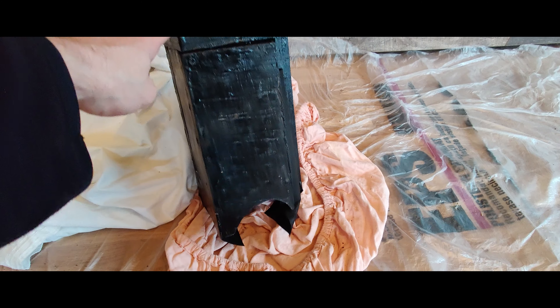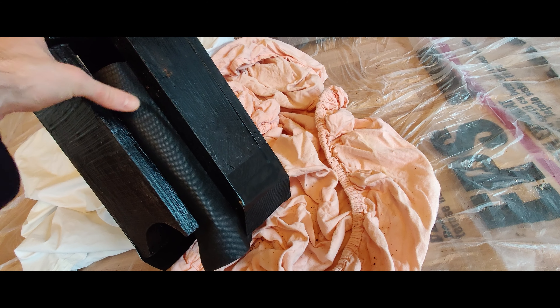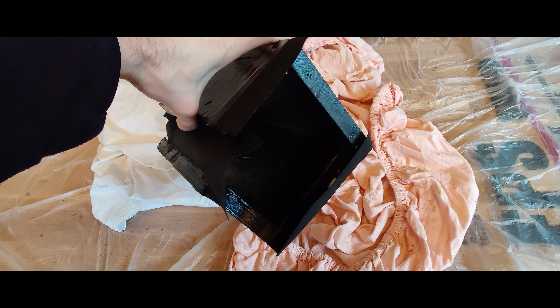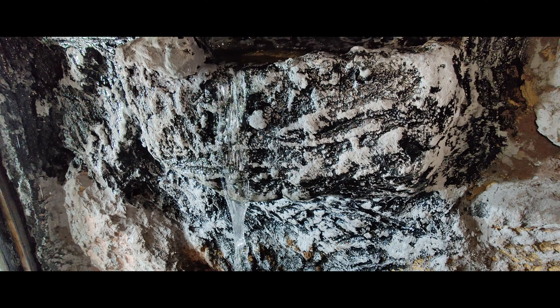As a maintenance hatch for the piping for our waterfall, I have built a small box out of spare Tegu sheet scraps, placed a hinge, some geotextile, and covered everything up with rubber-based hydro-insulation. I then inserted our basin and tested out the waterfall — and as you can see, it just drips down right on the edge of our basin.